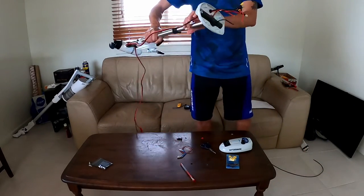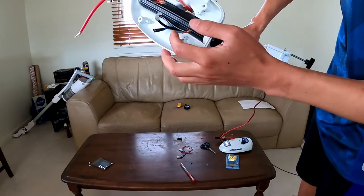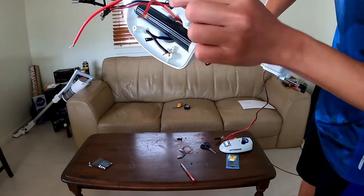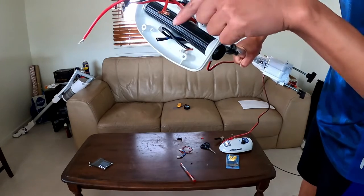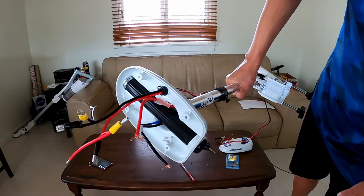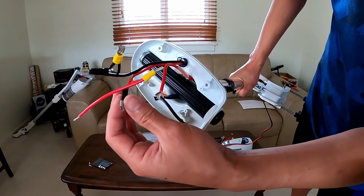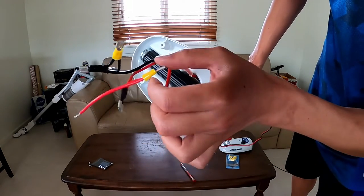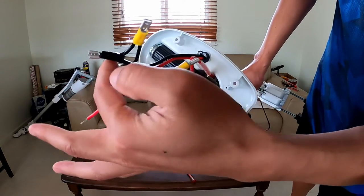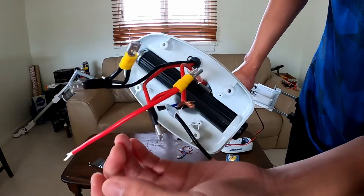On the Watersnake here, you can see that there's normally three cables that come out of the shaft. That's negative to the motor, and then positive to the motor, and then there's the blue cable as well, which is actually a coil line. We don't need a coil line, it becomes obsolete with the PWM controller. I've also spliced the lines for the positive, crimped on some female spade terminals, and done the same thing for the negative, crimped on an extra line to feed into the PWM controller.